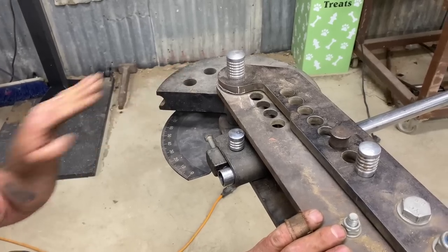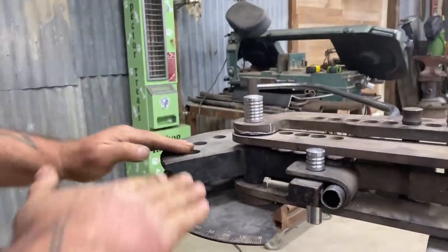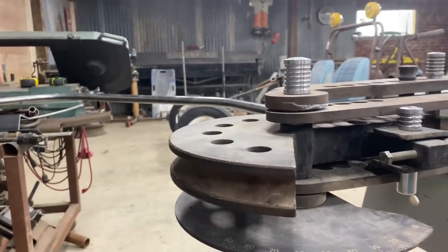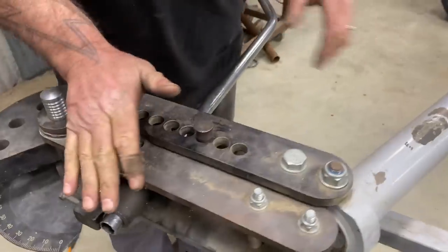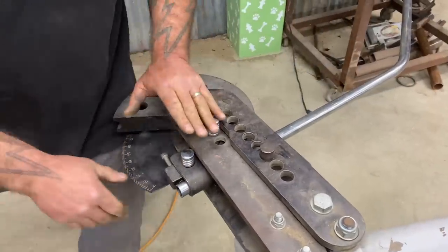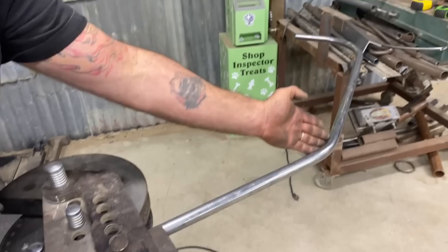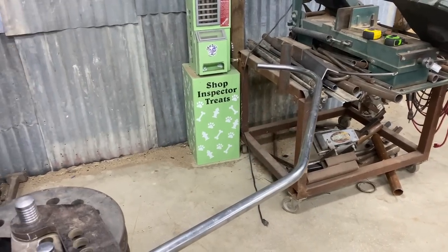All right, looking at this die, I'm looking at that bend. They are parallel. It's this plane here. Straight through and straight through every time. That's what makes it flat. That's gonna go back in there as soon as we find the spot. And this one is not gonna get pulled to 90. This one's gonna get pulled to being parallel with that one. So see, this changed the dynamic. It would be 90-90, but this, who knows? I didn't even measure that. I'm just eyeballing it.